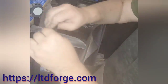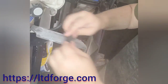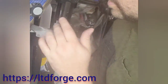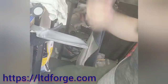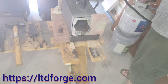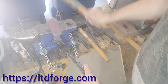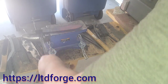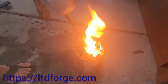This is the part everybody hates — inevitably you're going to have to hand sand unless you've got a 2x72 with all the different attachments, the big wheel, the small rollers, to put a more even cut on it. I noticed I have a lot of scratches from my 80 and 120 grit belts, so I'm using 220 grit right now. I'm paying a lot of attention to the tip because there are a couple of gashes going sideways — must have skipped on the sander. Now I'm doing a hammer pattern, so I've got the ball-peen hammer out and I'm just putting a nice dimpled texture over it. I've done this a couple times and I really like it.